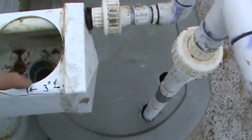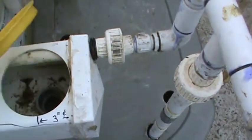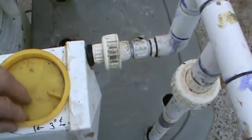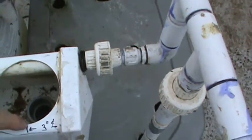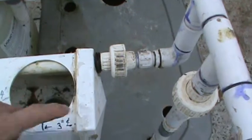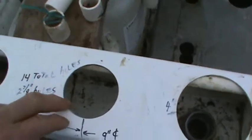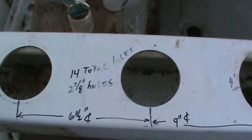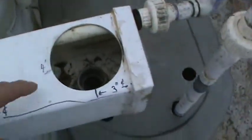The first hole is a 4 inch hole, and you use a sewer cap that they use for testing sewer lines — they glue these on and these work just perfect, they fit right on there. So the first hole, you use a hole saw and cut it out 3 inches from the end. The next hole's center will be 9 inches from the end — that's your first 2 and 7/8's hole. The spacing between them from there is 6 and a half inches to center, roughly. So there's a total of 14 holes with a 2 and 7/8's hole saw, and a 4 inch hole saw.